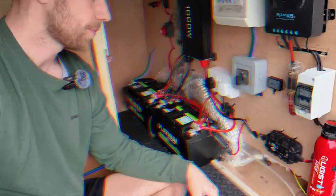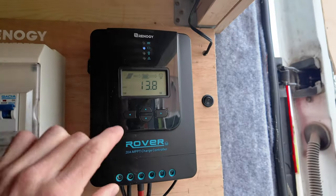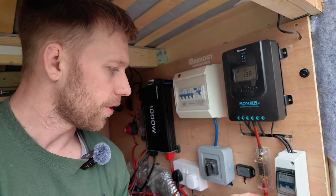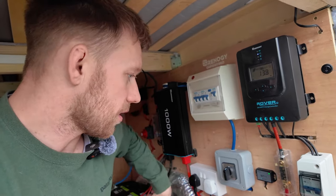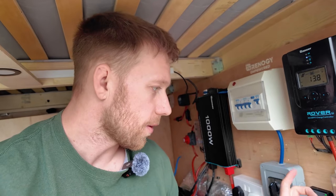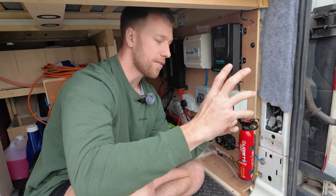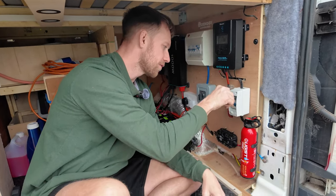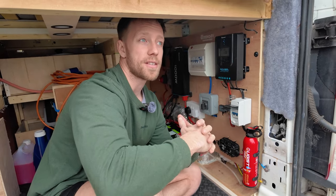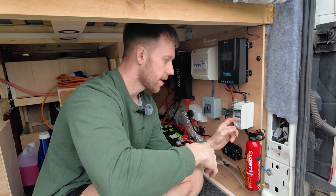Our solar setup consists of 200 watts of power on the roof and this MPPT charger — it's a 20 amp charger so I can only have 200 watts of solar, but that's been perfectly adequate. The positive cable, I believe this is 16mm supplied by Renogy, runs into the charging side of the batteries and the negative runs to the other battery. Everything is fused. I've also isolated the solar panels up top with a little fuse I picked up on eBay for about £12 — because even with all appliances off, UV rays mean the panels are still generating power, so you can't work on the solar unless it's isolated.